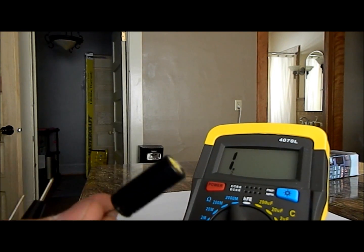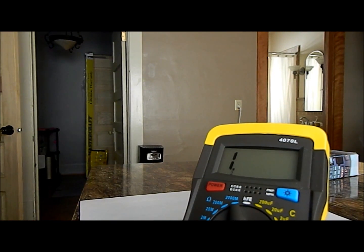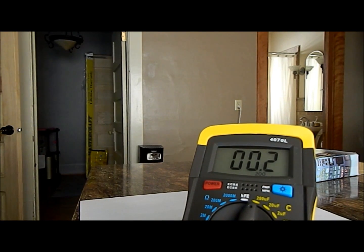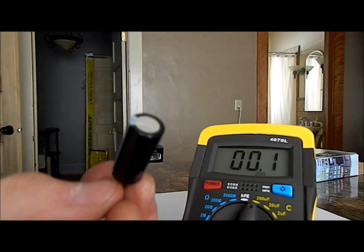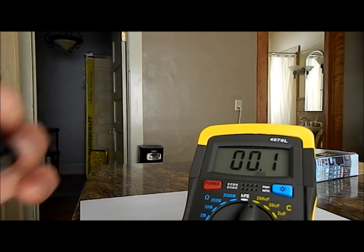They don't tell you for whatever reason. Maybe it's a made-in-factory thing, I don't know. I pulled it out of a camera flash from a disposable camera a long time ago. I'm assuming it's probably in the hundreds or so. I'm just gonna test it and see what we get. Would you look at that — roughly 90.0 microfarads. That's almost 100, so if you were gonna label this, you'd probably label it 100 microfarads. Sure packs quite a kick for the camera flash.